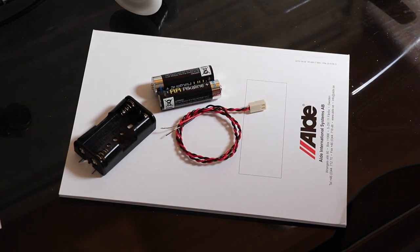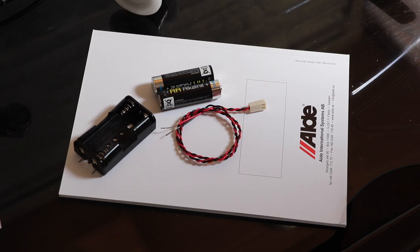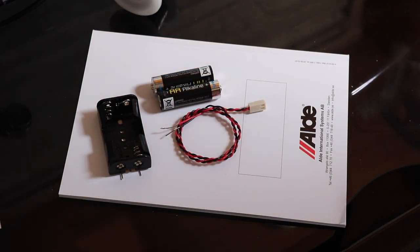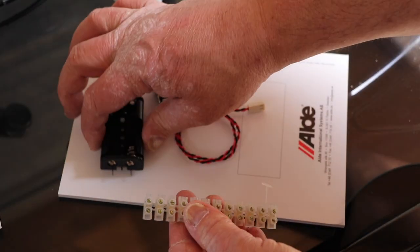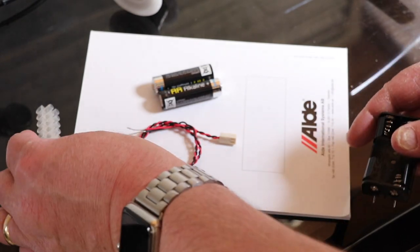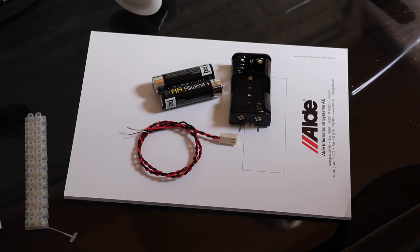They may not come in those colour arrangements — they may be blue, black, yellow and purple, whatever. The point is you'll have two different colours, and it's important to know that in a few moments time. Now I'm going to solder the cable onto this battery connection box. But if you don't have the ability to solder, don't worry — you can use terminal strip, attaching it onto the battery compartment and inserting your cable in as well. That makes for a very neat and tidy job. I'm going to go down the solder route though, because I like a good firm electrical and mechanical connection.